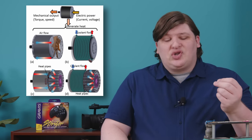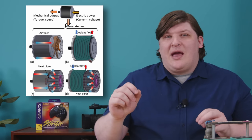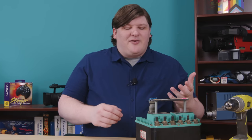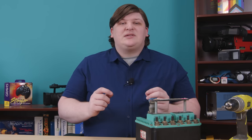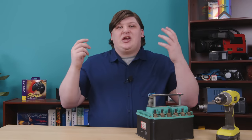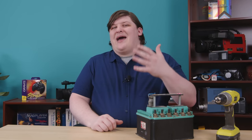The nature of electric motors is that they turn electricity into torque, but also into some amount of heat. The more resistance they meet when they try to turn, the more power they'll turn into heat. The nature of machines in general is that the parts are not self-aware. A motor asked to drive an immovable object like a jammed door won't notice that it's struggling. It'll just try and try until it overheats, melts its insulation, melts its windings, and probably starts a fire — destroying itself and endangering everything around it.